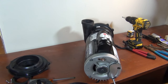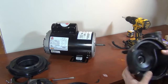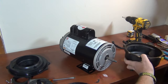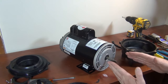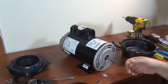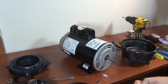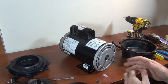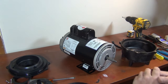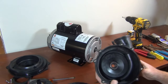Once you get all of them off, pull it off. Most pumps will have rust in here — clean that all up. The shaft might be bowed a bit from water and chemicals eating away at the steel, thinning it out. You've got to watch it from bending at all. If you keep it straight you might get a couple more years out of it, but if the shaft is too thin the impeller will just break right off.